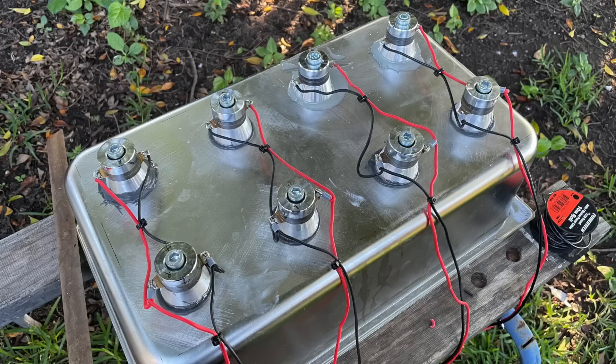Let's start with the voltage. The drivers were made for 220-volt AC and I was using 240 volts. Initially they thought this might have been an issue, but after consultation with their engineers they decided this was an unlikely cause. Regarding incorrect wiring — after sending them photos of my wiring, they told me what I had always suspected: the transducers were wired backwards. Even though I had double-checked with the previous seller and they had assured me it was correct, I had positive wired to negative and negative wired to positive. The new seller concluded this would probably not cause the drivers to fail, but I fixed the wiring anyway.